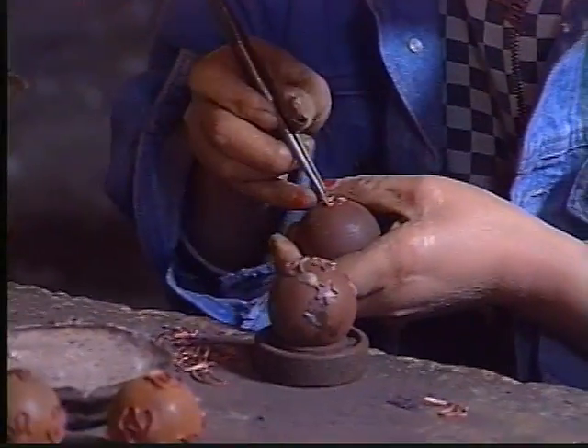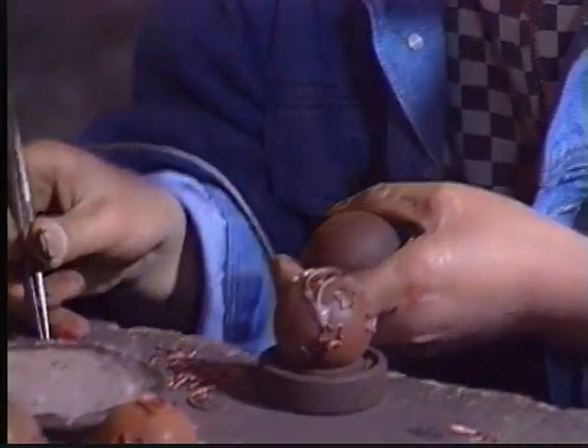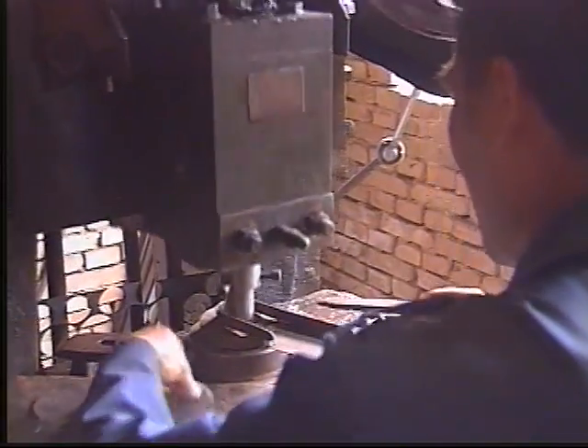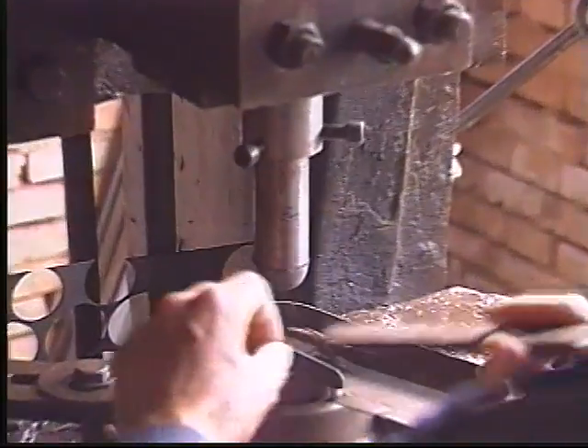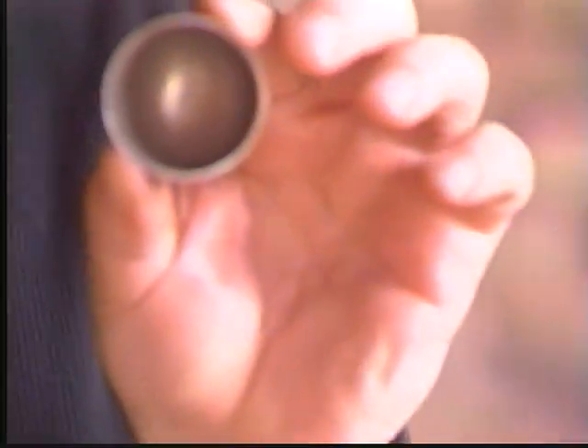At the Colored Dragon Iron Ball Factory, each set of cloisonné balls goes through a painstaking 14-step process that is performed almost entirely by hand. First, various sizes are stamped out to produce a circle. Step two: the metal is then pressed into a half sphere, which comes out looking just like this — a half sphere.